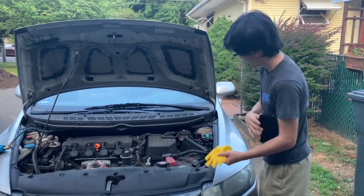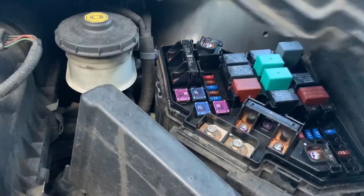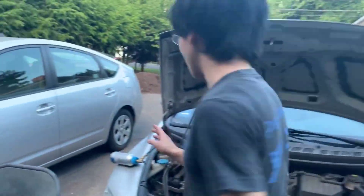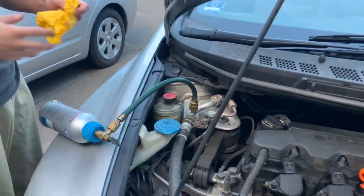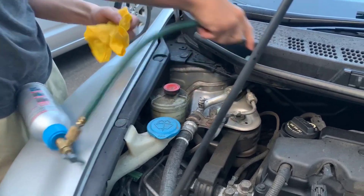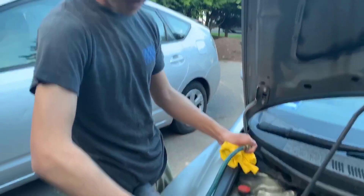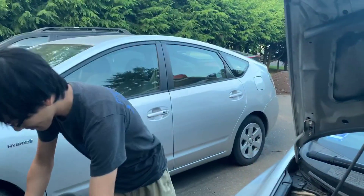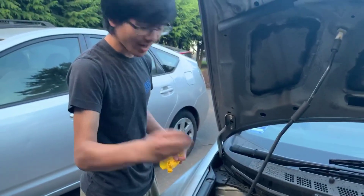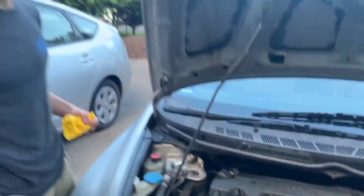By the way, don't forget to do cleanup. I already put the relay back in — don't forget that especially. Now we're going to put the cover back on and take the refrigerant off. This is going to be a bit tricky — actually, it shouldn't be tricky. Make sure that your refrigerant is closed before you take it out. Then put the low-pressure cap back on, and double-check your work to make sure everything is okay.